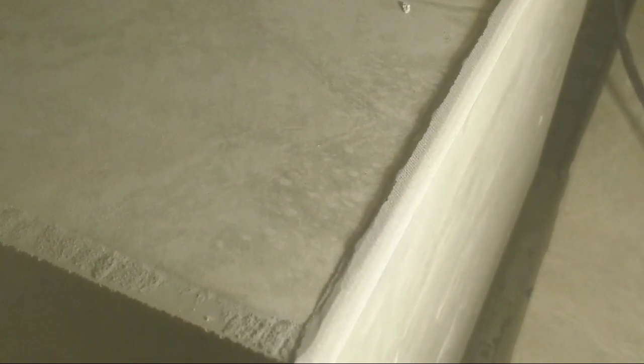Okay, now we have just produced this roundover. There it is. Now I need to take my palm sander to it. All right, I need to work that edge a little bit more, but you can see it no longer looks square like this does. All right, then we're going to take the corner here, and you're going to see it change. See, there we go. There's the difference right there. We just created this from this. We started out with this. We now have it rounded over. There's the difference. Okay, now I'm going to take my palm sander to it.